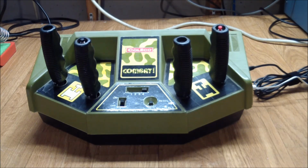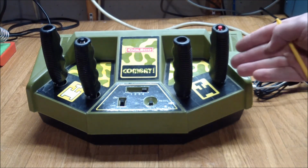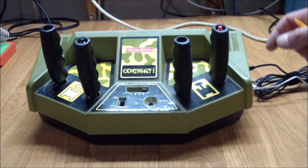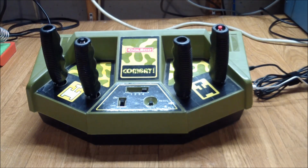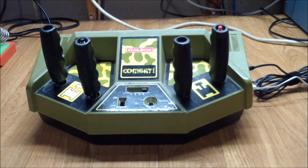And I gotta say, it's very rare. I've repaired quite a few video game consoles of that era and newer ones, and very rarely have I run into a malfunction such as this. I mean, either you have glue chips that have gone bad, things that are grounded, microprocessors that don't work, or ROMs that don't work. But when you get a self-contained chip that is powered correctly and clocked correctly, and it still acts like this, it most likely points to the chip itself.